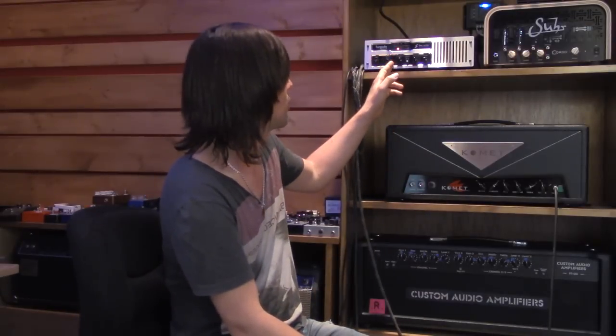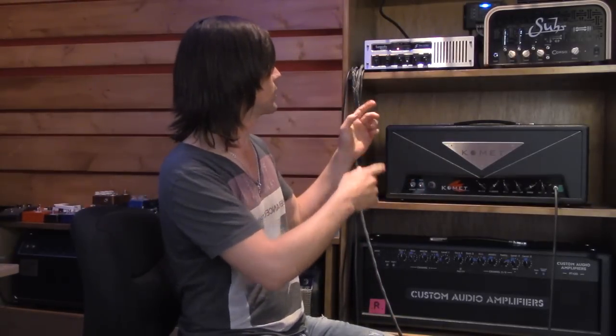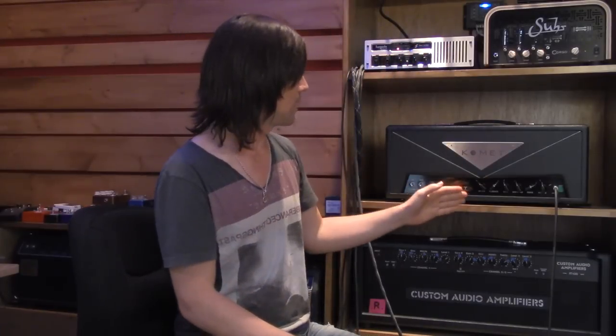So the third thing that the Torpedo Reload is designed to do exceptionally well is be a DI and guitar reamping box. Okay, so you can plug your guitar into the instrument input on the front, take the XLR output on the back, run that out to your microphone preamp and recording interface, and then within your digital audio workstation you can capture a full frequency DI guitar track. Okay? Then later on you can take that DI guitar track, run it back out through the Torpedo Reload, through that into a guitar amp, and of course a speaker cabinet and microphones, or possibly a plug-in like the Wall of Sound 3 or something like that, and you can just completely craft guitar tones after the fact, after you've actually already recorded the part.